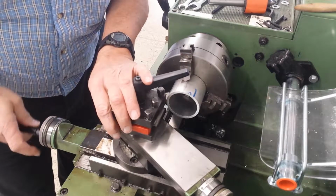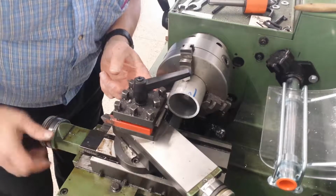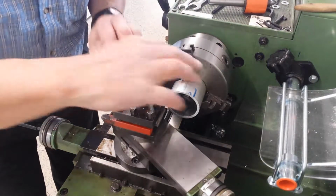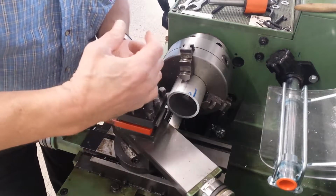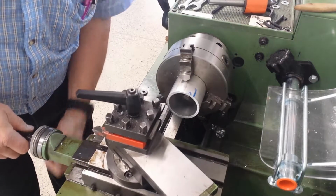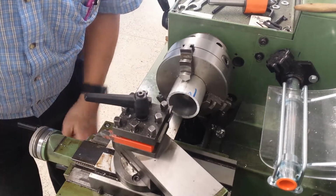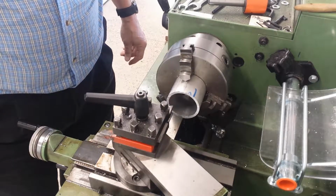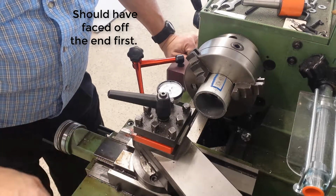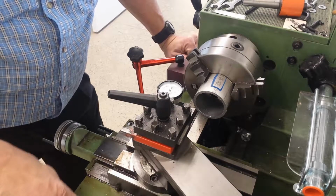I know that the threading tool angles are square with the back of the tool, because that's how I ground it. And I should point out, I am not an expert when it comes to machining, more of a doof. I'm going to run 12 threads per inch so I can go at any number on that dial. I did check that just to be sure.